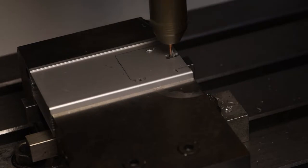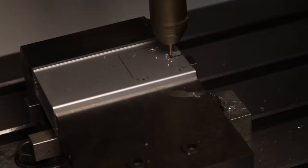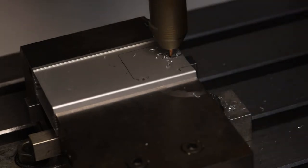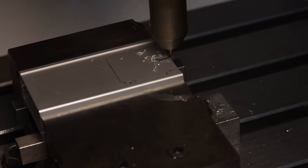That would put even more strain on the drill head, but this is really just a collection of partly overlapping holes. As soon as we're done with this part, we will smooth it out by going once around the edges to remove those ridges. So see that in a second. Right now, as you can see behind the drill head, there is a smooth surface for the sides of the aluminium.